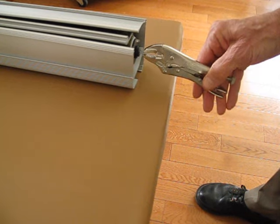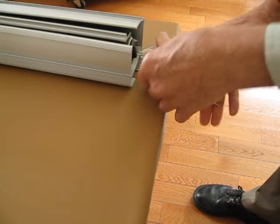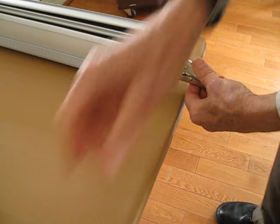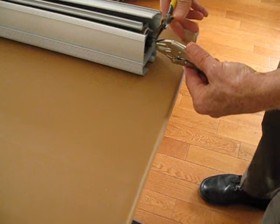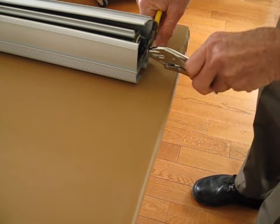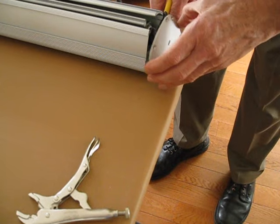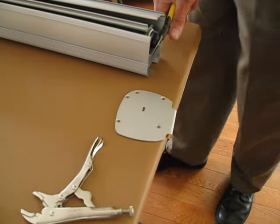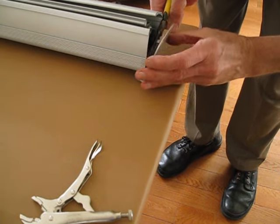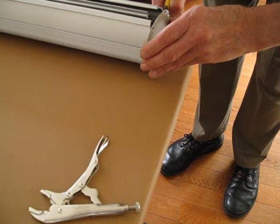So that when you pull the banner all the way out next time, it'll come all the way back in. Now I've got it about where I want it. If I let go of this, it would go spinning. Now I take my needle nose pliers behind here and grab hold of it so I can take off the vice grips. That allows me then to take the cap and be able to slip it on. I must be very careful or I'll lose it from the other side right now. So I slip my cap on, fitting it to that flat hole, and that will catch it so it can't spin out of control.